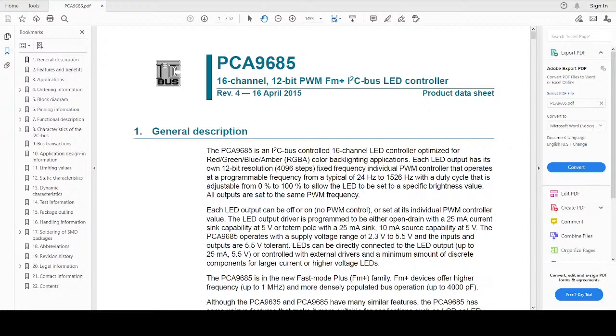When you look at the way my robot lab drives these little boards, it actually takes it from around 500 microseconds up to 2500 microseconds, and that near enough doubles the range, which is really cool. So what we're going to do is hook up to one of these and have a look how my robot lab drives it, and we will see it's actually using exactly the same sort of technology, same pulses, and we will capture the I2C just to show the communication on that and how quick the communication is relative to those pulses. So I'll just connect that up now.